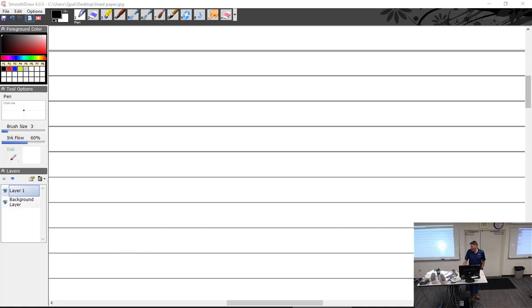And one of the things that I was taught to do is draw file it, which is basically to take a file and just run down the entire blade leading edge, clean off any imperfections and sand it down real smooth. And that is common, and then put some Alodine on it and paint it.